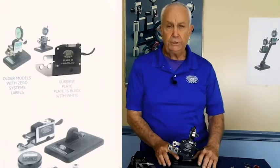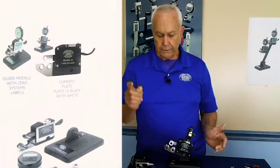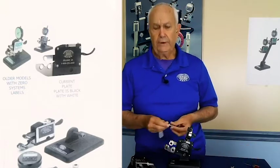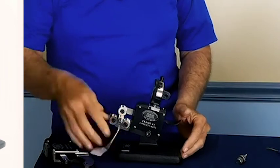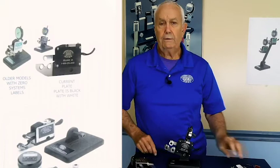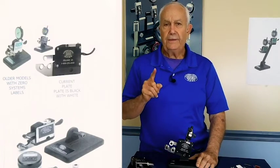Now today we're going to be showing you a tri-roll. This is a tri-roll. Got 3 rolls on it, hooked to a frame. It's got an indicator, a base. It's used to very quickly inspect product threads. You simply put the product thread in, read on the indicator what it checks. This instrument here, the tri-roll, it checks an external product thread and their features.